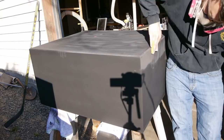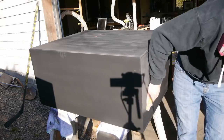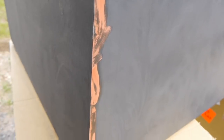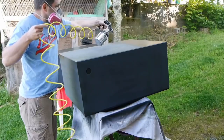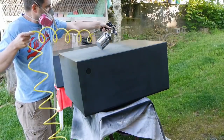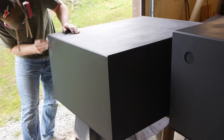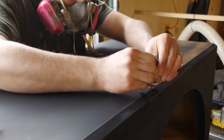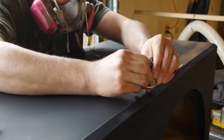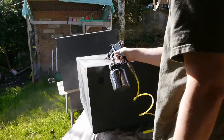Constructing the box is more fun and looks a little more impressive, but finishing is half the work. I go over every side, and any little specks or divots or MDF seams, I hit it with some putty, then sand it back and spray primer again. This process is annoying. Finishing can be really fun, but when it comes to black paint, it's the worst. I just go over and over again — every time I sand it back, I look real close and see what I can find, and there's always something.